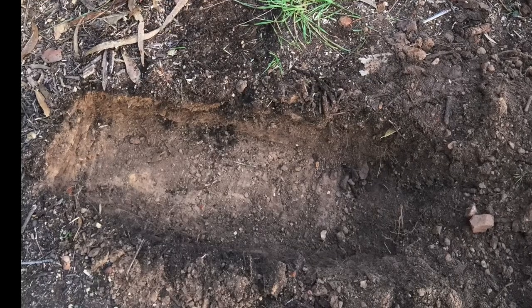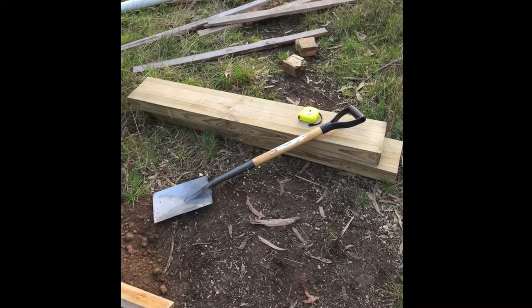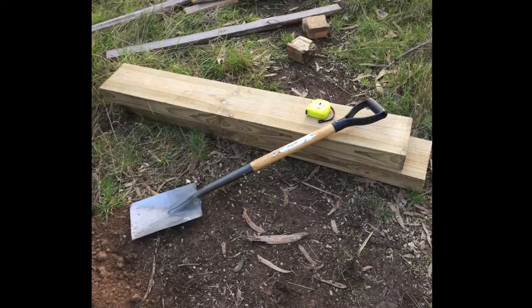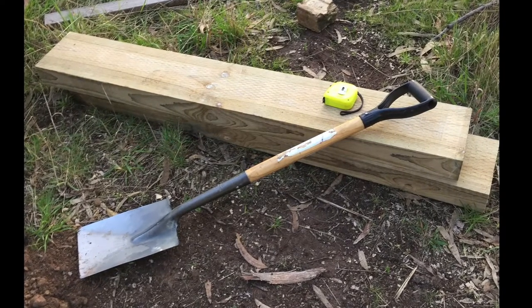You can actually build a slope into this stool — as long as you get the legs flat, if it's down a hill you can cut your legs different lengths and keep the base level. It's absolutely imperative that the base the tank sits on is level, because with that much weight you can't have it crooked. You will need a spirit level to do this job.